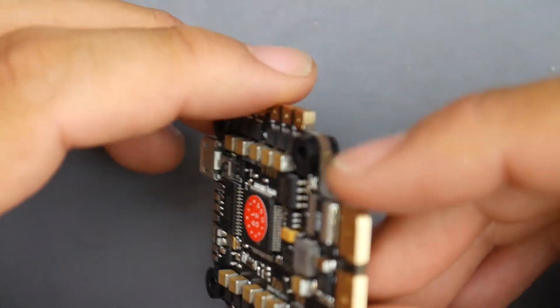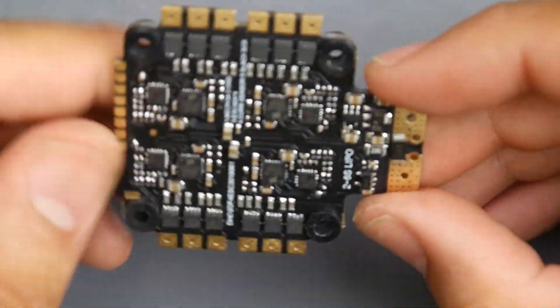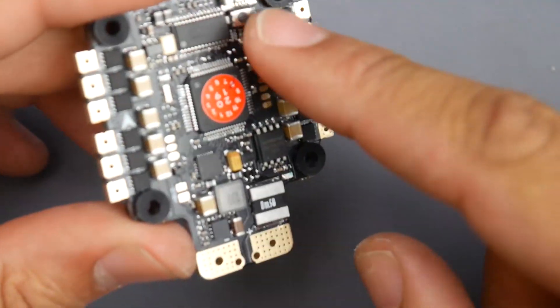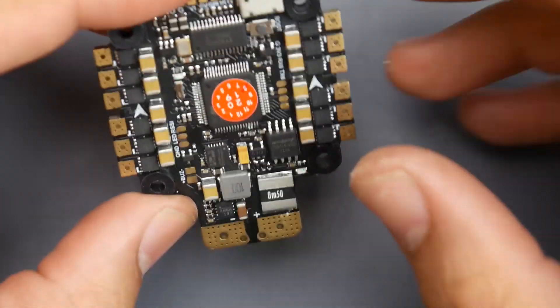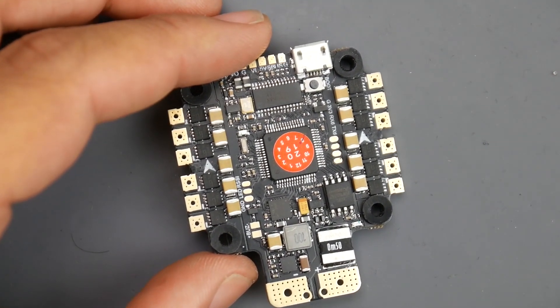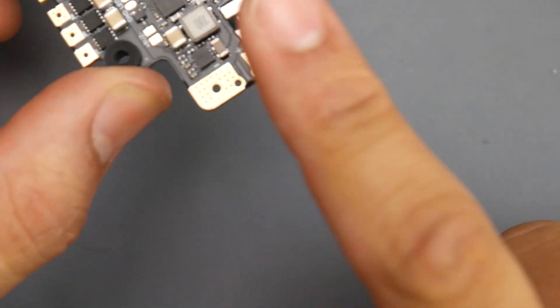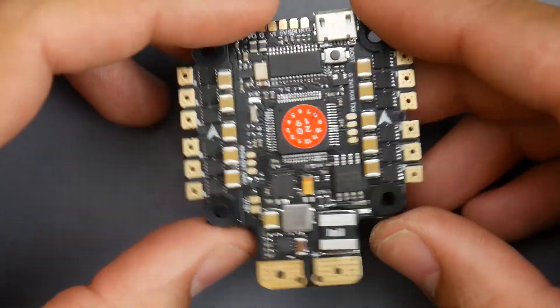I really did love these back then. Back then, we didn't have such powerful motors as we do now, and this is supposedly 6S capable. However, I wouldn't trust it on a 6S personally. Filtration looks okay. These are really big capacitors here and they should filter out most things. They also provide you with a proper Rubicon low ESR capacitor, which is expected to be installed here. Running 4S or 6S, you have to install it. If you don't, expect problems.